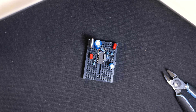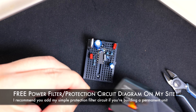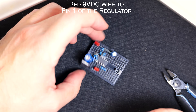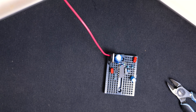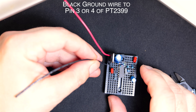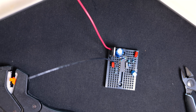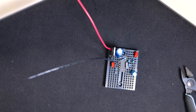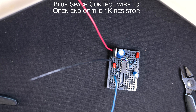So let's just add our wires now. We need firstly a wire for our input power — our 9 volt input. You just get a piece of wire, strip it, and then poke it into the hole where it's needed. Then we need our ground done. That's the advantage of connecting up all those grounds on the board — you just need one ground wire now. Okay so now we need a wire going out to our space control — that controls the reverb, delay time and all that sort of stuff. That's from that 1k resistor we put in. If you put it too much lower than 1k you get a lot of latching issues with this circuit.